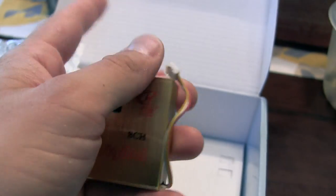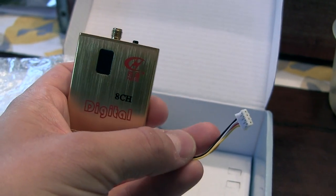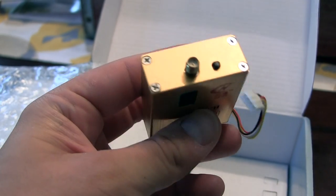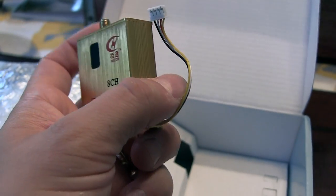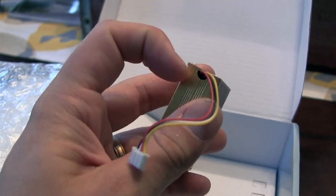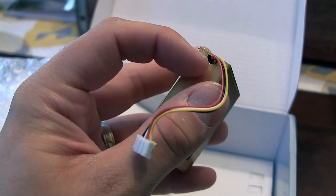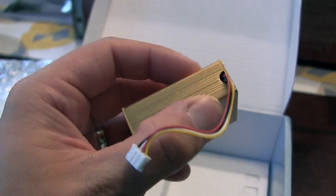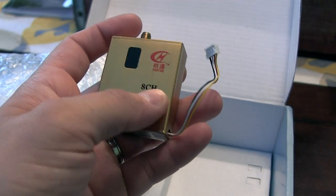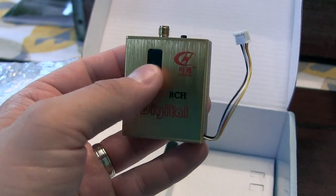Here's our transmitter with a little cap on top to protect the SMA connector. This is where we're going to cut and splice in our connector that will work well on our planes — nice heat sink on it. What I like to do is open the bottom case and run some heat shrink after cutting, to basically make a stress reliever at the corner. That way, if the plane goes down and the cable gets pulled, it won't disconnect from inside the case — just gives a little strain relief.